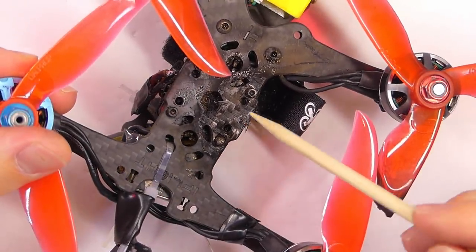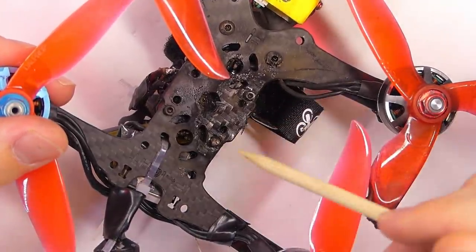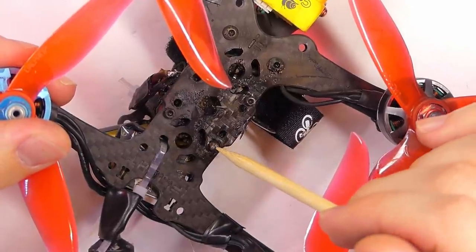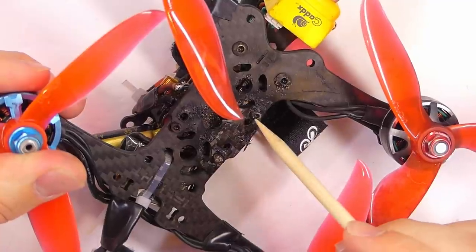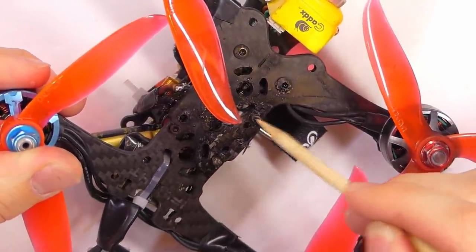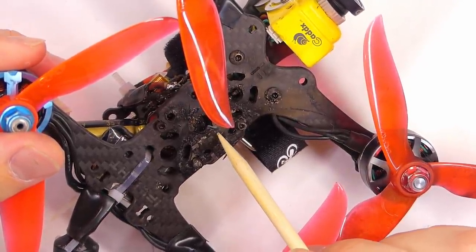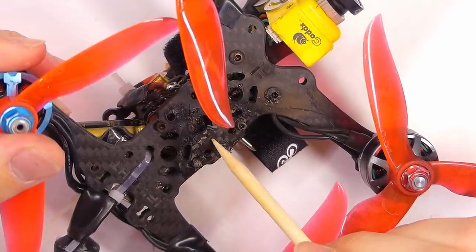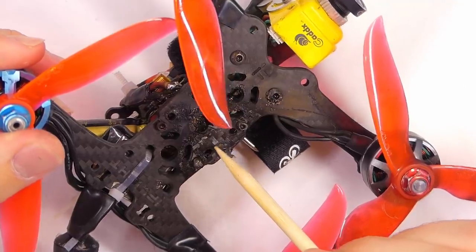This is just bananas. I mean, this thing was not on fire for very long, but it melted this screw right here. See that? It's just a melted blob now, and it used to be this hex screw. And these are metal screws, not plastic screws. Also, you can see the weave of the carbon fiber, the actual fibers of the carbon fiber. Look at that. Totally just delaminated. It just melted the epoxy holding these fibers together.